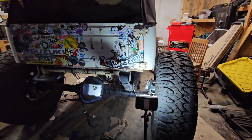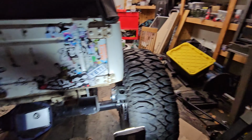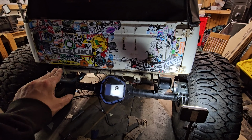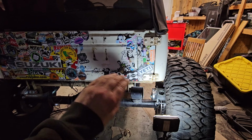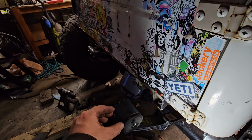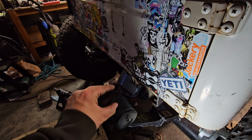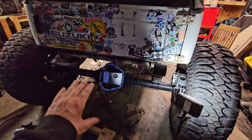In the next video, what we're going to have to do is I have some rectangular tubing down there, and we're going to build a really simple bumper that just welds onto the frame, and then I'm just going to try to weld it to that tube as much as I can, gusset it heavily to those frame plates in the side. What we're going to do is have basically a 2x3 come off of it, hold a shackle hanger basically right above this, and then when the shackle's on there, it's going to hold it on. So very small, minimalist bumper.